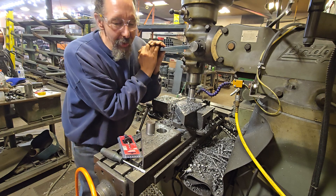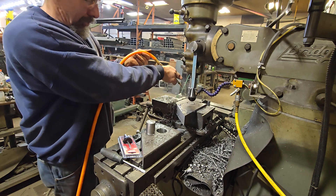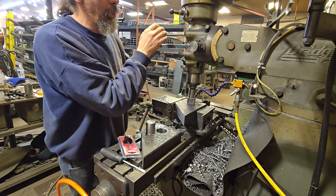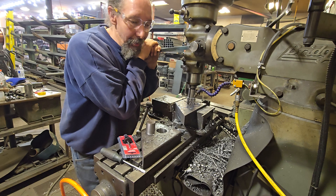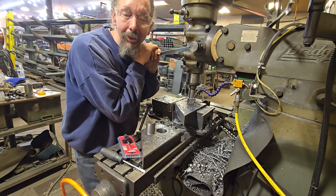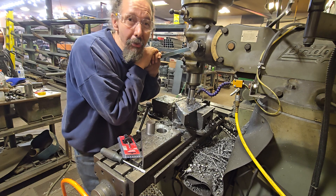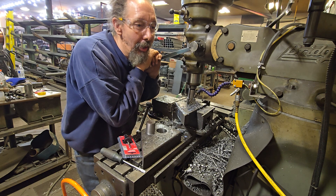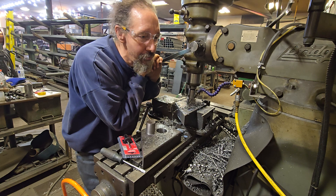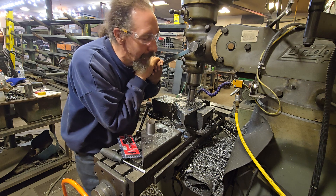If you go to YouTube and look up annular cutters, you'll see Caterpillar or other heavy machinery companies with a four or five inch boring tool — a big annular cutter large enough to stick your leg through the hole — running at a thousand RPM and pushing through four inches of steel in 30 seconds. That's great for industry, but that's probably a $30,000 cutter running in a water bath on equipment that weighs 50,000 pounds. So it doesn't get vibration. Those factors all come into play pretty heavily.